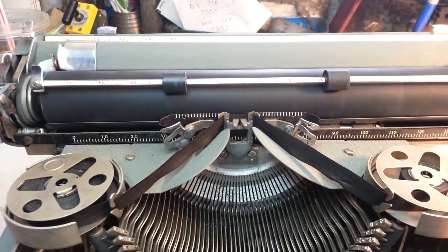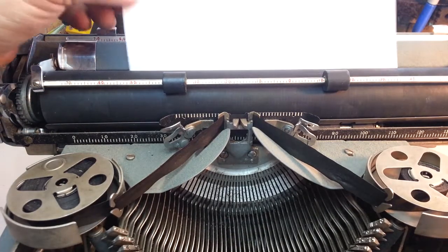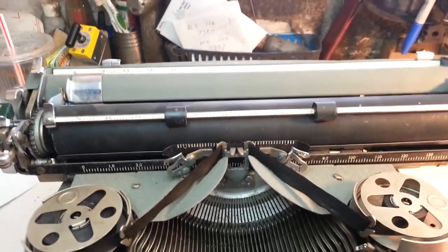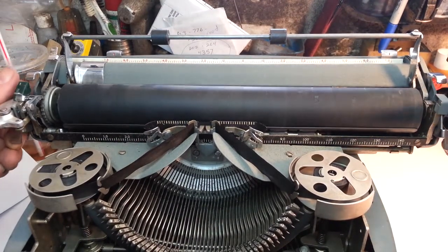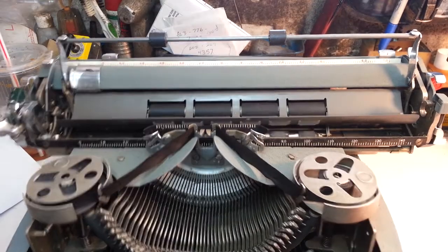this side of the platen feed rollers. So when you rolled the paper through, it just went crooked like that. And so this does have a pretty easily removable platen. You just flick these little levers here, and this platen roller comes right on out of there. So I got investigating in here.